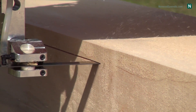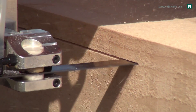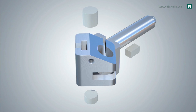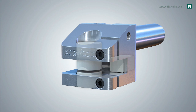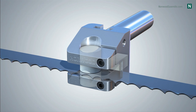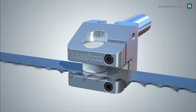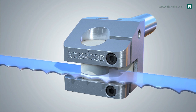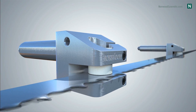The Lumber Pro's DuraGuide ceramic blade guides give full three-sided blade support for maximum stability. The Norwood blade guides are CNC machined from aluminum billet material to form a precision housing that holds the blade guide ceramics. These zirconium-strengthened alumina oxide ceramics are made to precise tolerances and provide superior support and guidance for the blade to better control blade flutter and deflection. These advanced alumina ceramics enable a blade to run smoother, cooler, and considerably quieter than other guide types. With proper use, they will last for years and prolong blade life by 30%.